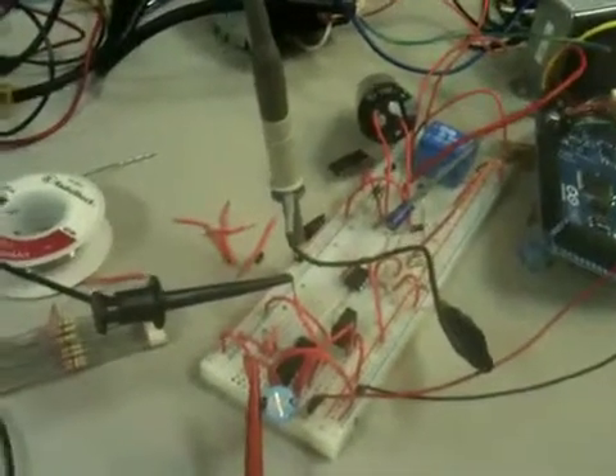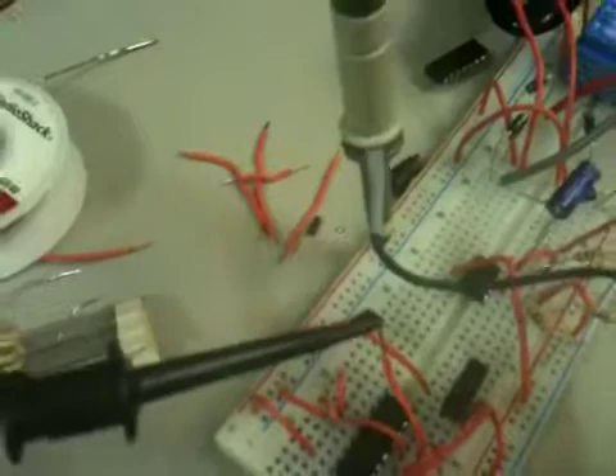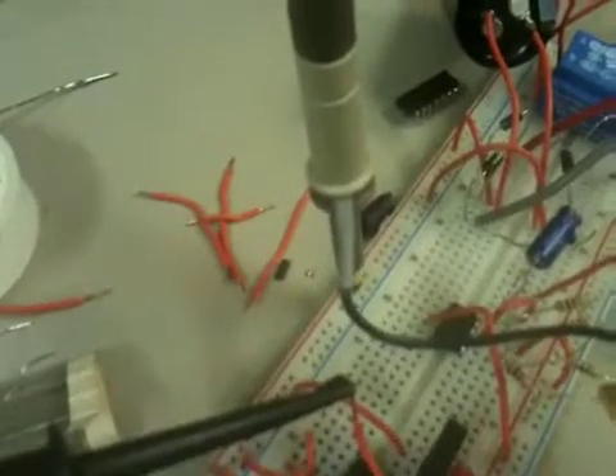This is the rectifier and buck converter test. What this test is checking is basically if the ripples, even with a really noisy circuit right now, would cause any weird outcome on the power. What we wanted to make sure is that the peak-to-peak, or the voltage swing away from the average, doesn't bring it outside of a range of operations that we use.